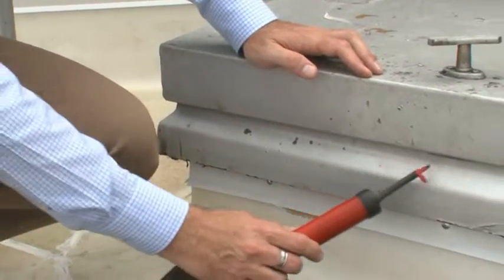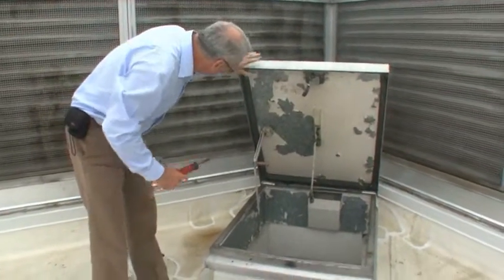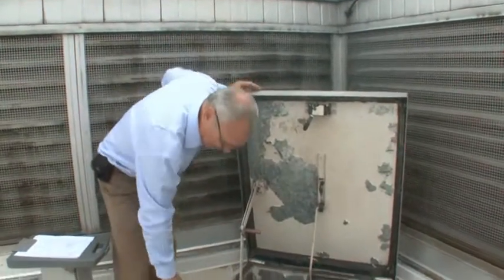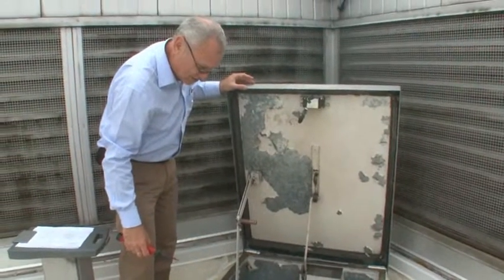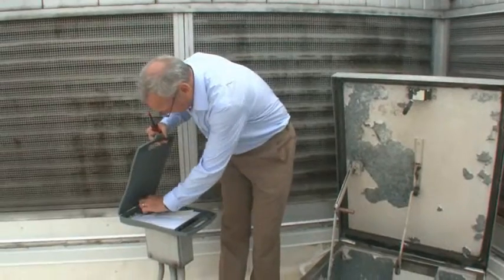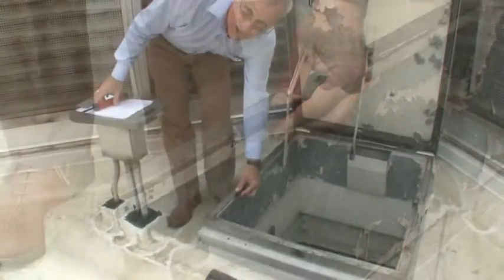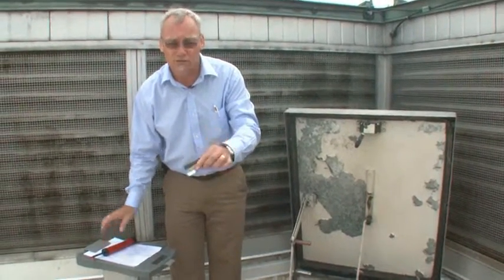We're getting a bit of pressure from down below. What happens is the weather seal — especially in the corners — gets degraded, and this isn't quite level, so you don't get a good seal when it's shut. We have a system where we'll weather strip using a compression seal — it's a door set — and we'll put it on the framing so the door shuts into it. This will outlast the existing material and take up to a three-eighths warp from season to season.